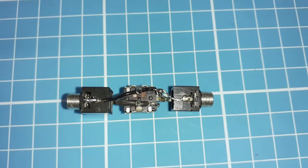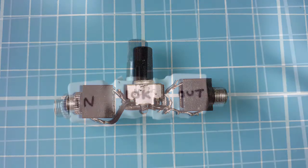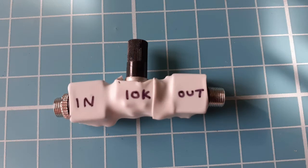I got a couple of small sockets and my small potentiometer and wired them up as per the circuit diagram. I then got some heat shrink tubing — white heat shrink so I could write on it — to mark which was the input and which was the output. On one end I put one of those knurled locking screws on the jack socket threads so I'd know which one was the input even after the heat shrink was on. That's it — a passive circuit, three components, all wrapped in a bit of heat shrink.